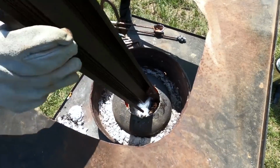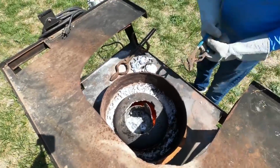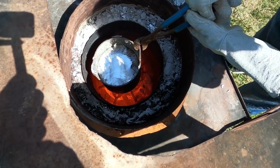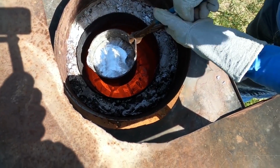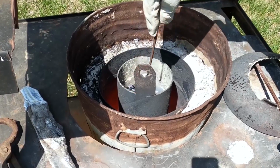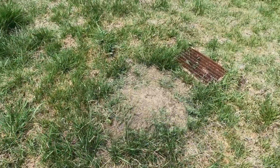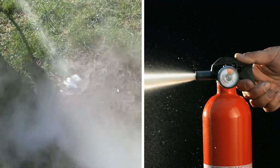So to combat them, first you need to take some aluminum for the cast, and a furnace set up to heat your aluminum. Always play it safe and melt more than you anticipate using. Enlarge the entrance of the mold to create a depression around it for the aluminum to flow into. Clear any flammable debris from the area and make sure you have a fire extinguisher nearby.